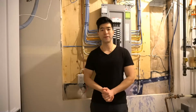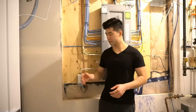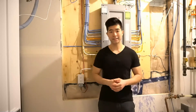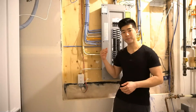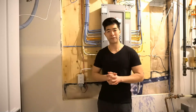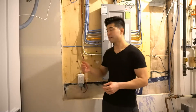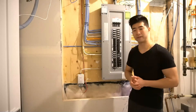Hello my friends, welcome! Thanks for joining my channel. If you're new here, my name is Kevin. In this video I want to show you guys how to install a panel plug next to your electrical panel. First thing first, safety first — the first thing you want to do is to turn off your main breaker on your electrical panel.